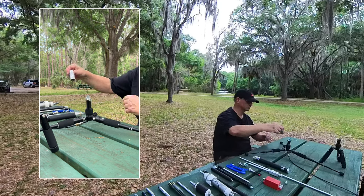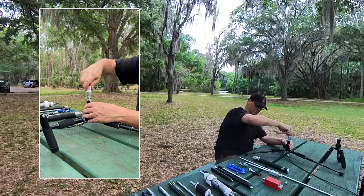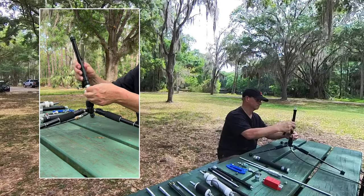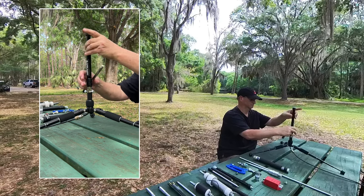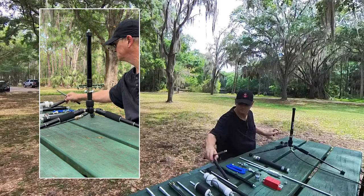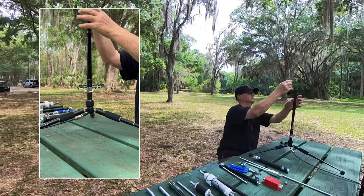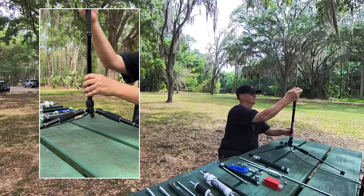If you want to stay with the UHF post and need to run a 3/8x24 antenna, you can use an 8035M adapter. We switched over to the 3/8x24 version of the post, and of course we're going to put the G Gable 7350TC 3/8x24 version antenna. It's a broadband HF antenna. We're going to put that 80 meter coil on and then put the telescoping antenna on top.